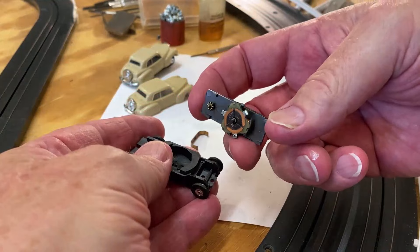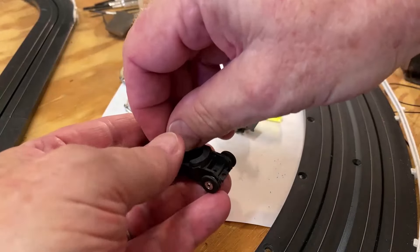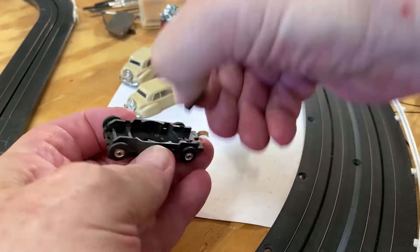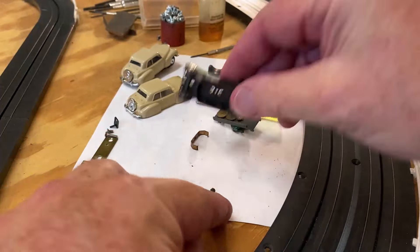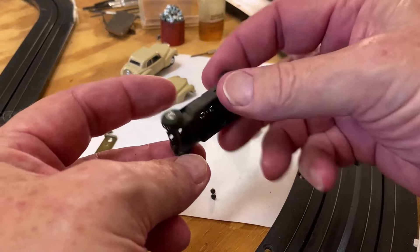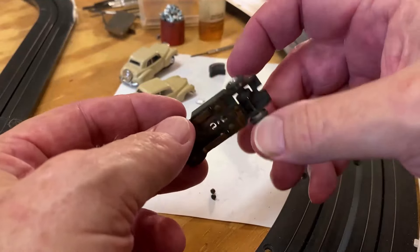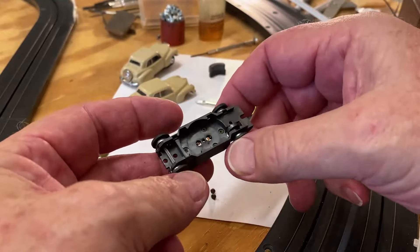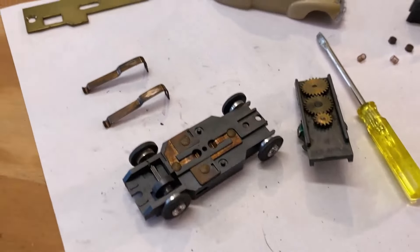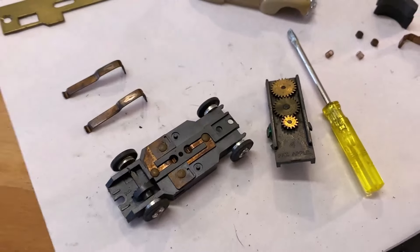While the bumpers are drying, I'm going to take the bottom of the comb plate. They oiled the heck out of it — look at all the carbon and oil down there. We'll get that cleaned up. The brushes are not too bad; you can tell they've been worn. I'll get them out of there. I'll take it apart a bit further, get the axles off and everything. The top doesn't look like it has any verdigris on it whatsoever, so I'm going to go ahead and get the Dremel wire brush and we'll get this thing cleaned up.